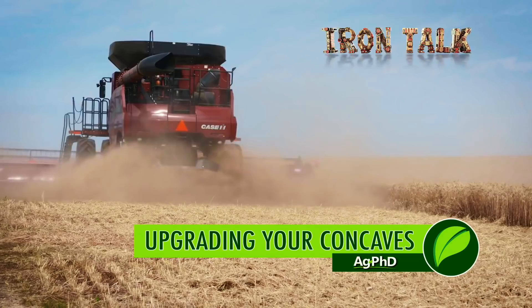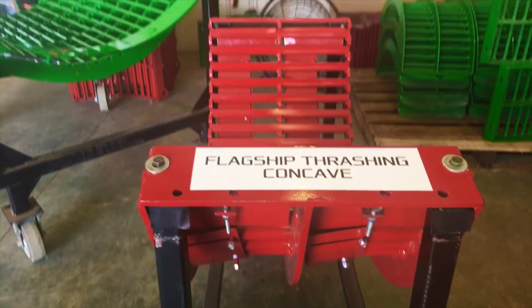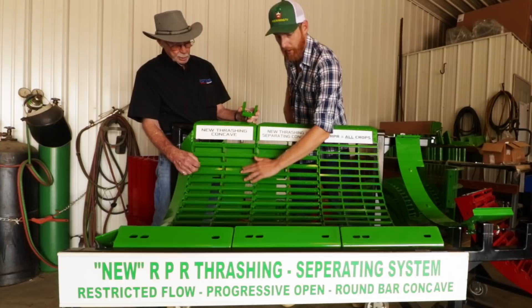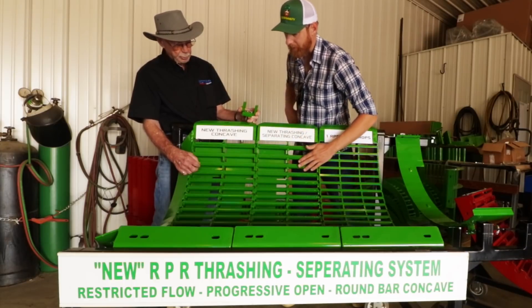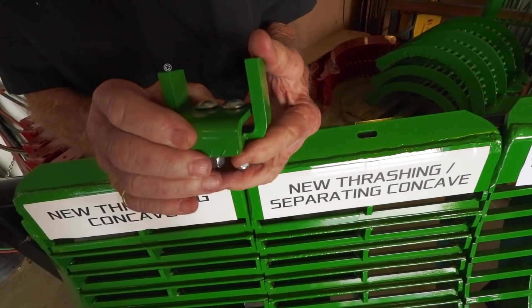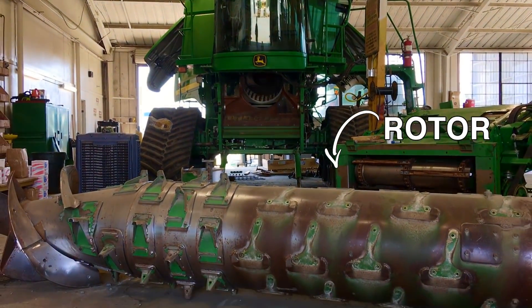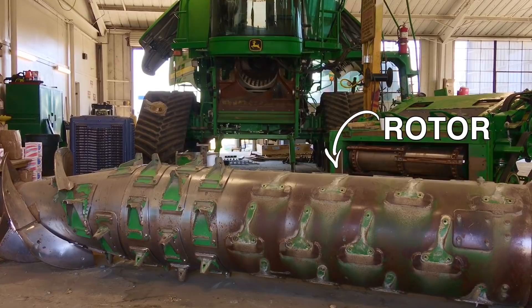He's been featured on shows like American Farmer and Ag PhD. I'll leave the links to those segments down in the description box for a complete overview of the system, insight into the manufacturing, and testimonials from happy farmers. The John Deere set, for example, includes two threshing concaves, one separating concave, three adjustable cover plates allowing you to customize for whichever grain you're harvesting, and seven disruptor lugs. Concaves encompass the underside of the harvest combine's rotor. The rotor spins at around 700 RPM, threshing crops, separating — in our case — rice from straw. The rice falls through the concaves.